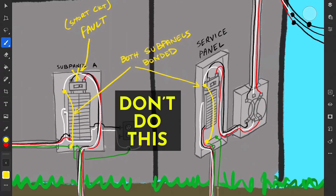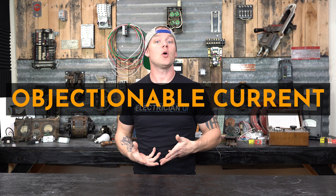The most important thing to know is that we don't want to bond at multiple different locations. We don't want every single panel in a house to have this neutral-to-ground bond — only the service panel. The reason is a term called objectionable current, which is basically current going somewhere you don't intend it to go. When we have a fault in an electrical circuit, we want to guarantee we've built a solid path — we know exactly where that current is going to go, and we're in control of electricity from the fault point back to the source. So it responsibly goes where we want it to.